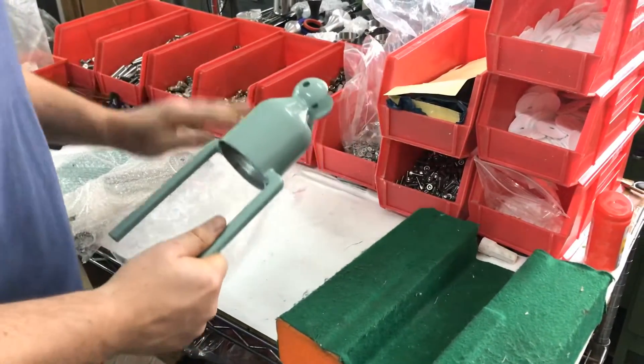This black mark here — I know that's a handling scratch, so I'll polish it out now with some buffing compound. If they're really bad, I'll mark the spot, then flat it down with 800 grit, then go to 1200, 1500, 2000 to smooth out any major defects, buff it afterwards, and put a wax on it to try and get it presentable.